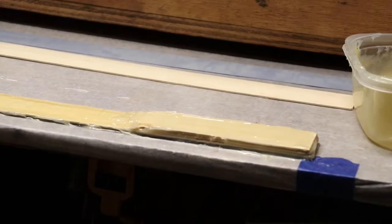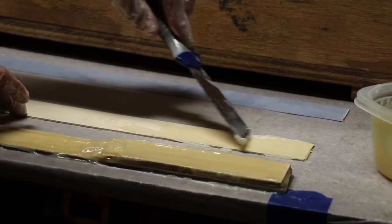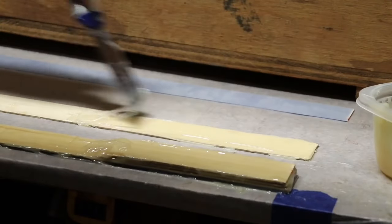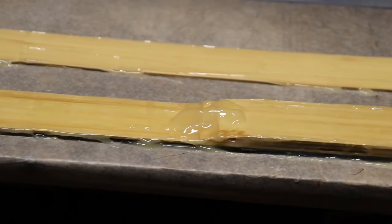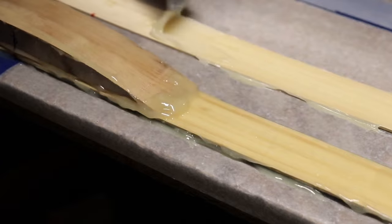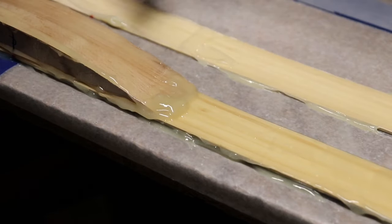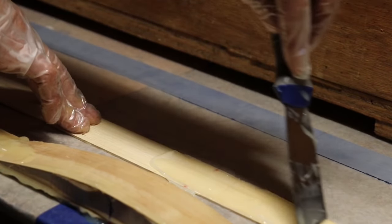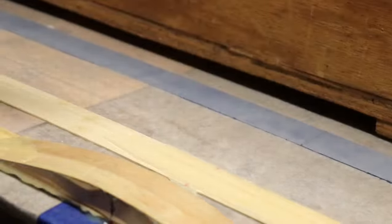There's nothing wrong with any glue that's already starting to squeeze out or glob out the sides — you can scrape that off and reuse it, put it somewhere where it's needed. Where I put those wedges down at the beginning of the sandwich there's a glob, because that's another spot where the back and belly laminations have to go around the wedge and around the handle. Just take your time — it's not frantic. Just make sure you're doing careful surgery. No dry spots.